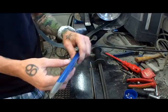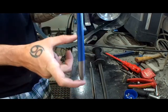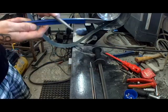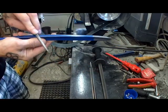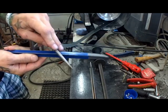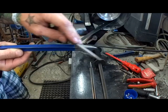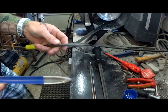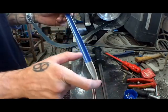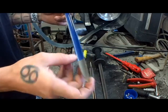It's hardened in the front, just about 10 centimeters or 4 inches are hardened. The rest is pretty soft. At this point here is weak steel, you feel it, the file bites into it, and here it starts scraping off, and here it's just slipping over it like glass. So only almost the tip of these things is hardened, but that's more than enough for a dagger,